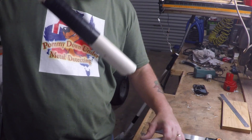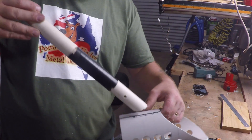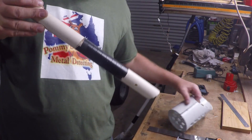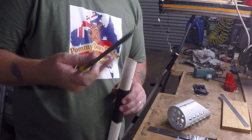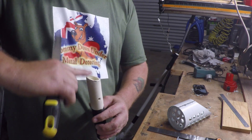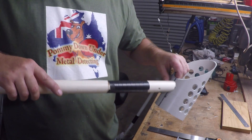The angle that you need to cut on here is about 70 degrees - seven zero - for that to go on there, and I found that to be about the right sort of angle. The other thing you'll probably want to do is take a beveled file and just try and round it slightly, just so that it fits a bit better on the top of the pipe.